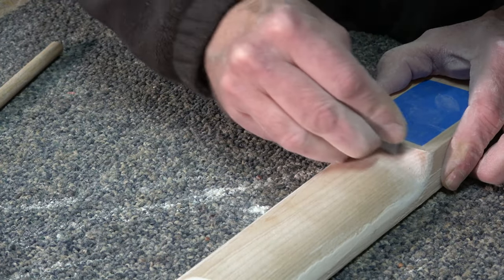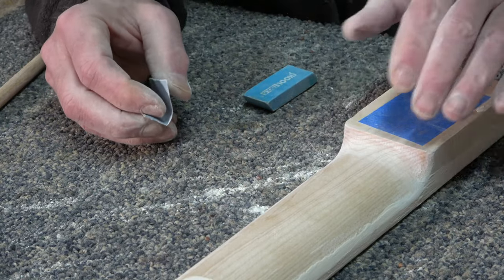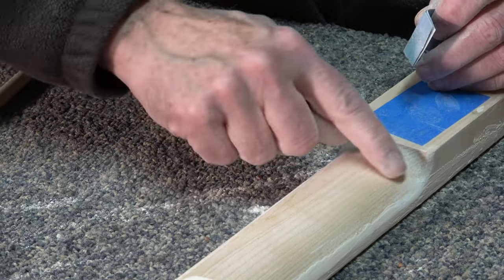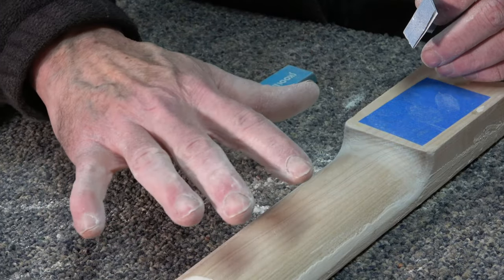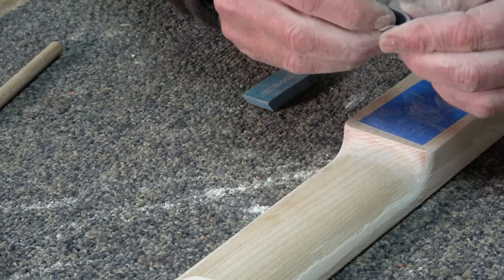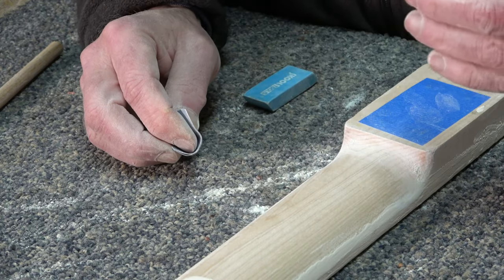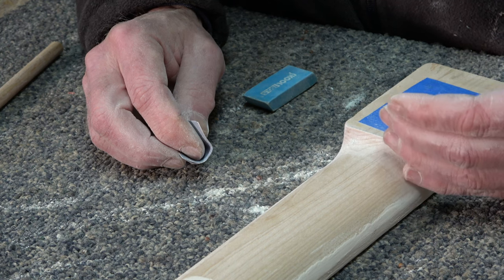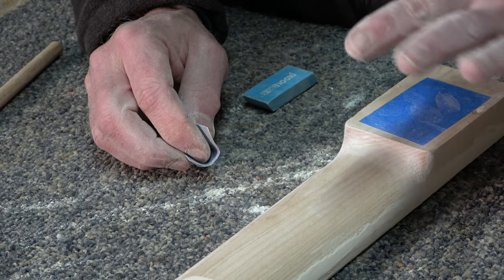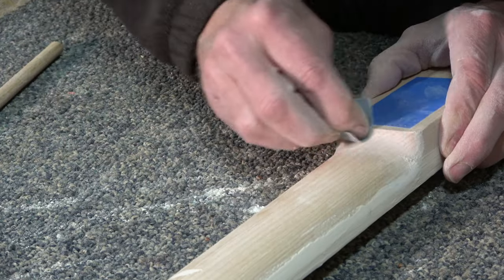As you can see here, I'm sanding across the grain. And I know that for some folks that's going to be considered a big no-no — that you should never sand across the grain. But really, that's only for sanding large areas of furniture where you're going to see lots of grain on a flat surface. Sanding in the direction of the grain allows you to keep the scratches going in the same direction as the grain. But in tight areas like this, there's no problem with going across the grain to get rid of tool marks. Because I'm going to progress up through the grits all the way to 400, and by the time I get to 400 grit you can't really see the sanding scratches going across the grain — they're just too small to detect with the naked eye. So don't be afraid of going across the grain to get these areas smooth.